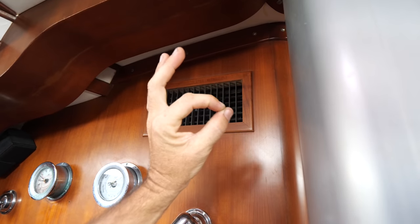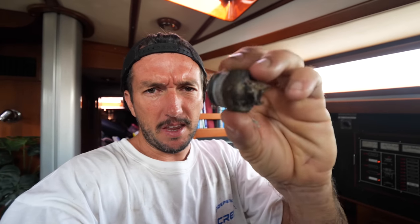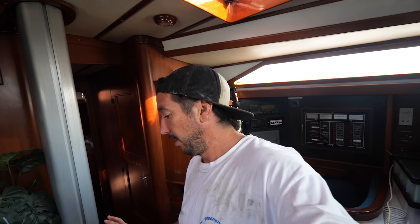She may sound a little bit rough at the moment, but let her work out her own wrinkles. That was a big fix that happened yesterday — we've got both aircons running now. The saloon aircon and the one in the aft cabin are both operational, which is really good. There was a blockage in the outflow waterline for the aft aircon. We found this fitting that was fully blocked. All of that has been changed — the aircon in the aft runs a lot smoother than the saloon one. She's operating. Today's going to be the first full day it's on all day. That's blowing cold air. Let's have a cold boat to work in.